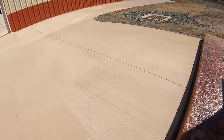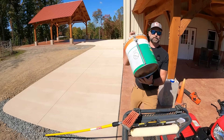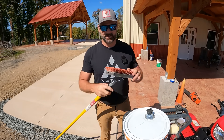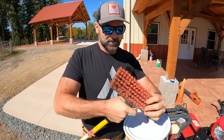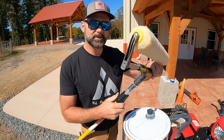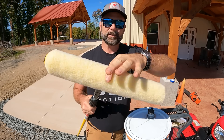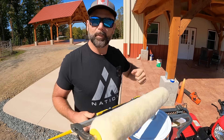This is what the stamped and dyed concrete looks like — this should have a higher gloss when we get done. That's the goal: to beautify and protect, to get this popping. Here's the product we're going to use today. I'll post a link to a good sealer down in the video description. What my contractor uses around here might be different than what your contractor would use locally. I'm sure there are plenty of options at your local big box store, but do some research. We're going to take off the brush and put our extra large Purdy roller on — I think it's a 16-inch roller, almost nearly double the size of a standard roller. You want to get a nice thick nap so it applies easily.